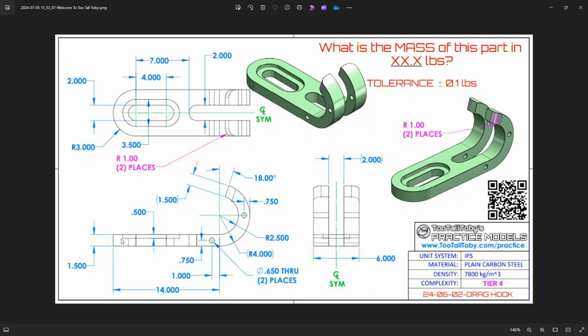We have basically just a straight segment, and an arc segment that has an 18-degree angle back from the center point of this arc. We have some slot features here and some key reference information, like this extends out a certain distance from the center point, and it's just giving us some width values and a length value. So anyways, it's just some backwards math to calculate these, but fairly simple to do, and we'll show you how to do this in IronCAD.